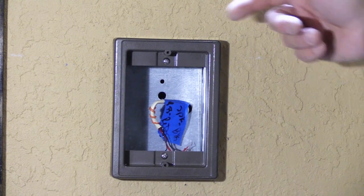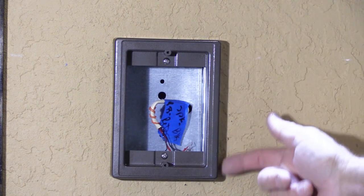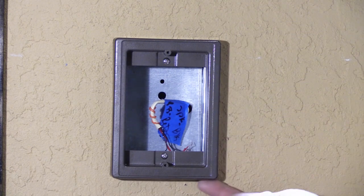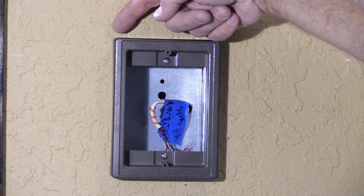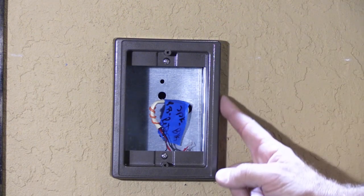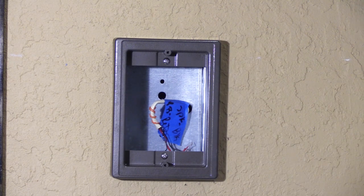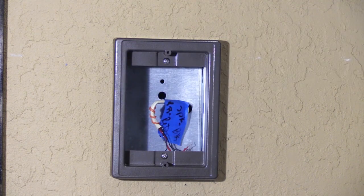That's pretty easy. If your stucco is very heavy or irregular in texture, you might have some gaps along the sides. If you do, you can use a little bit of clear silicone or painter's caulking — the type that comes out white but turns clear as it dries. You want to fill up the cracks because you don't want water getting down behind the speaker and into the inside of your wall, so sealing it up is important.